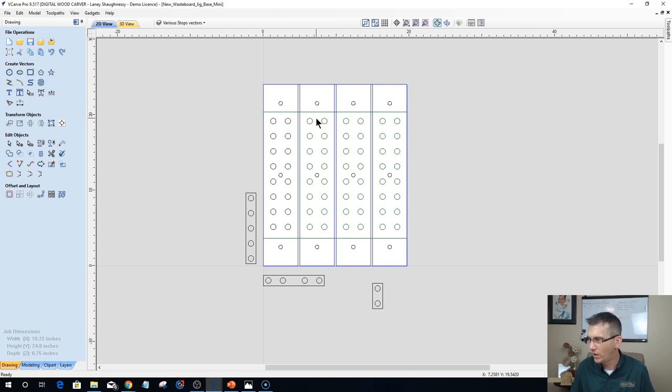All right, let's see here. We got one last question. What would a good speed rate for the surfacing bit be? When you're surfacing, you're only taking off a few thousandths of an inch. You want to run that at a high speed. For my 1 3/8 bit, I'm running it around 70, 75 inches per minute, stepping over 33 1/3% of that bit, plunging about 10 inches per minute, because it's not a plunging bit, it's a surfacing bit. I'm running my RPMs around 16,000. On my router, for you guys and girls that have a router, it's like between the 3 and 4 on the dial.